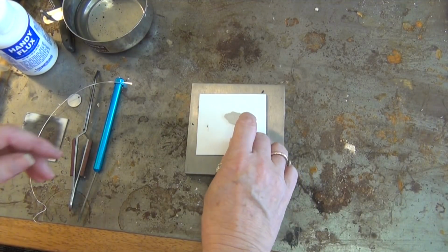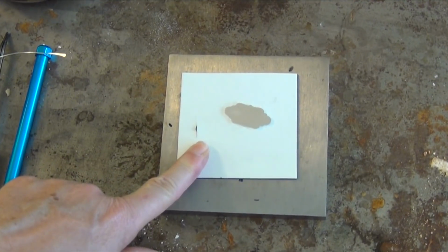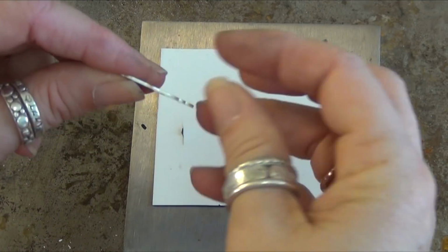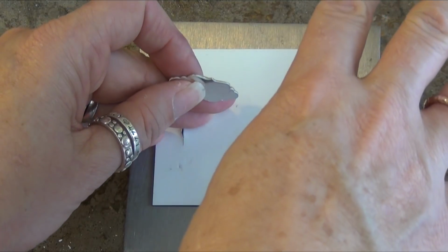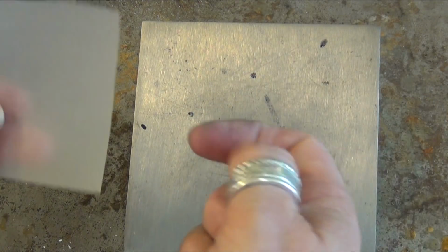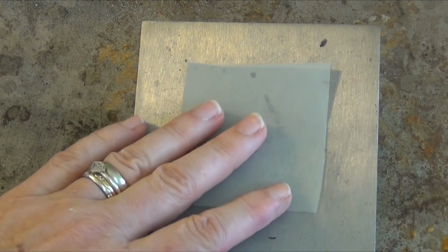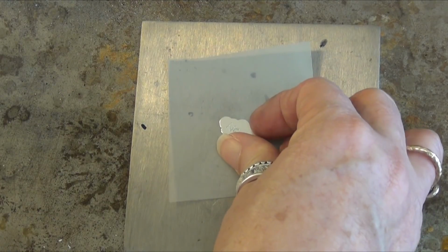But when I stamped on that, hoping that the plastic would protect the back of my piece, it actually is so thick here that the metal really protruded through, and it gives it this cushion to dent through on the other side. So I actually didn't prefer this, but I started thinking, well then I just need something that's hard plastic, and I was walking around the office and I found these laminating sheets. So it's just a big old laminating sheet that I cut a piece off, and I used that on my bench block when I stamped.